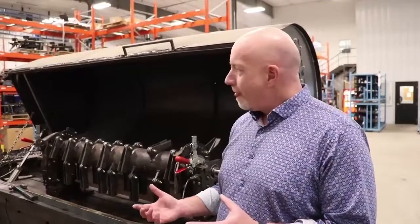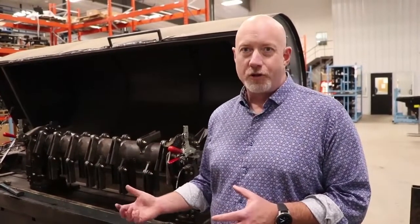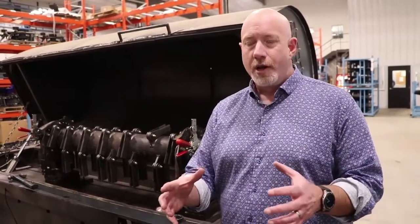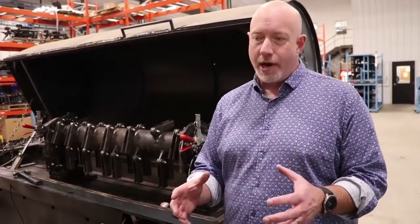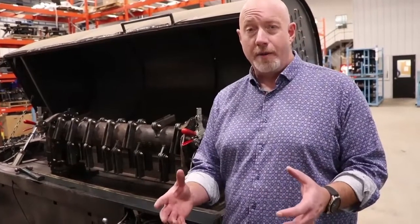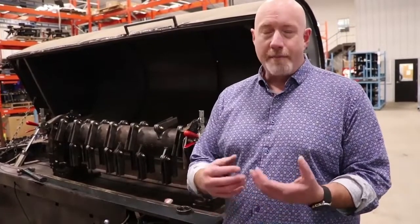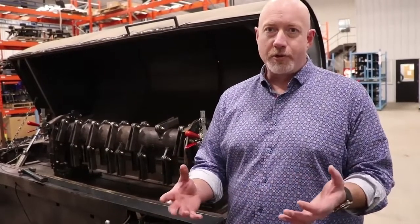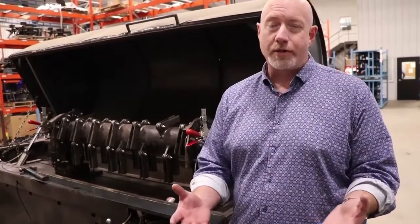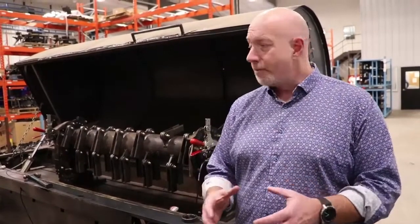This is our balancer. It may not look like the fanciest piece of equipment, but it's probably one of our most critical pieces of equipment in the shop, because whether it's our straw chopper rotors or the rotor in the seed control unit, balancing those is extremely important. A little bit of vibration has a huge negative impact on the back end of the combine or on the seed control unit, and if those vibrations get bad enough, they can throw all kinds of damage onto the body of the combine. It can throw sparks, and if you get sparks under harvest conditions, we know that's a bad thing. So making sure the choppers and the rotors are in balance is extremely important.